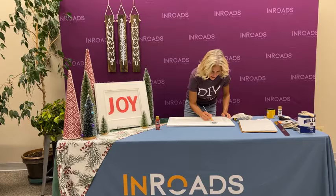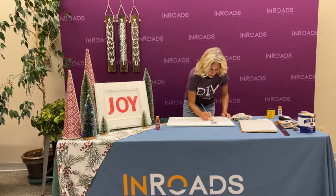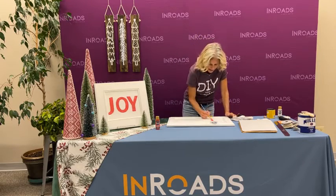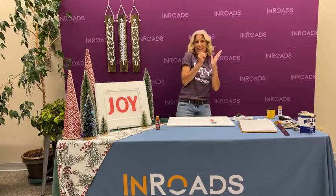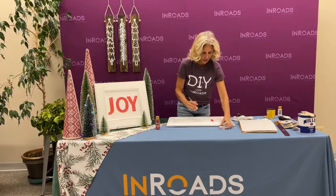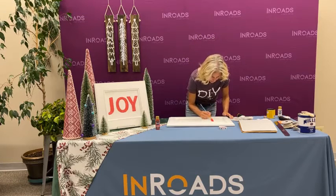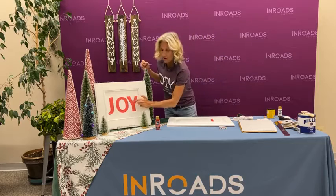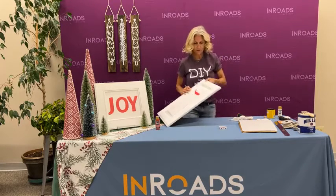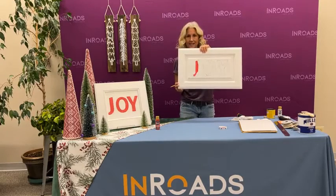Now, the reason I did all this work with the screwdriver is because with the paint, sometimes you go over your line, especially when you're stenciling. This has created a groove. You have created a groove, and so the paint is going to go down into the groove. And that's the great part about this little step that I told you my bestie showed, is that you're going to get that really clean seam. Here, I'll show you. See? Tight. Very tight.